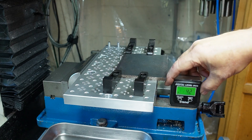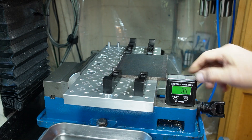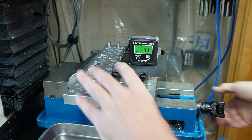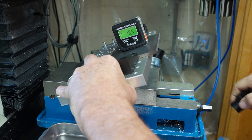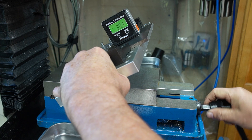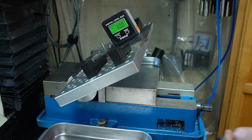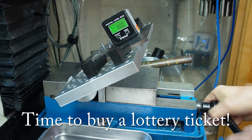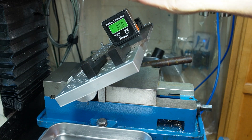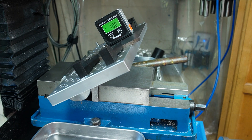Just to show it in use — I would zero on my mill vise, put the part on there, and go to the angle I want. Let's say I want 30 degrees in this case. There's a little beyond 30... and I hit 30 right on the button. Then I tighten it down and I can bring my mill down there and cut my part, whatever I want. Okay, let's get on with making that gib.